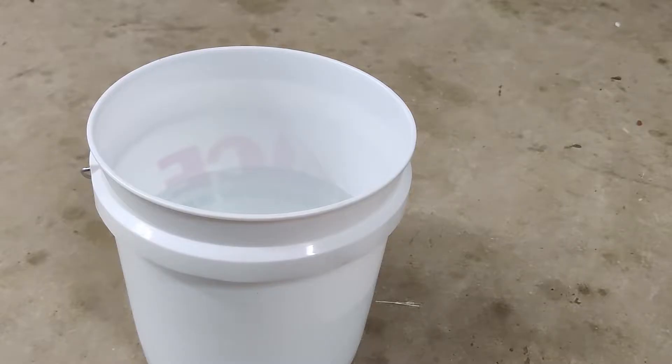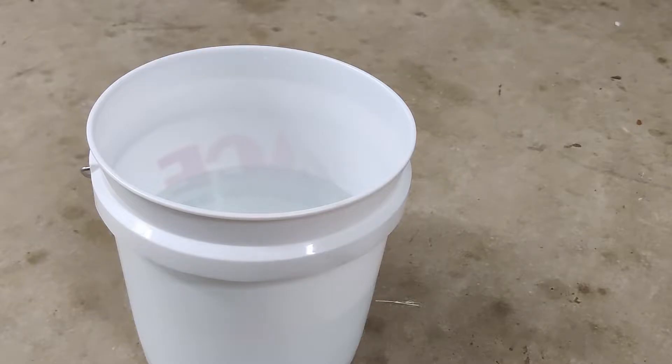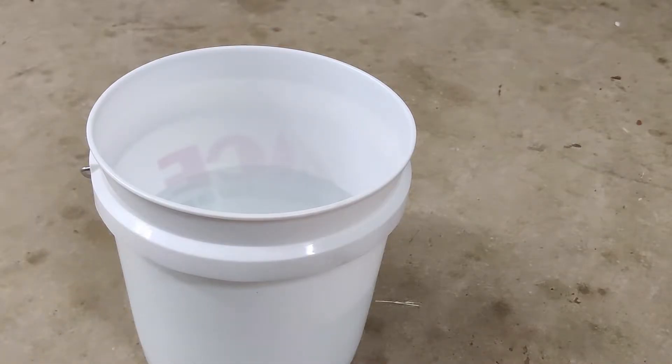The solution is about 75 degrees right now and still cooling off. You want to run your anodizing bath at around 70 degrees — if it gets beyond about 80 degrees you start getting splotchy, questionable results on your parts. Sometimes I'll put the bucket into another container with ice and water to regulate the temperature. You won't have as much of a problem if you use a bigger bucket or a larger amount of solution. Just try to keep in mind it should be around 70 degrees for optimal results.